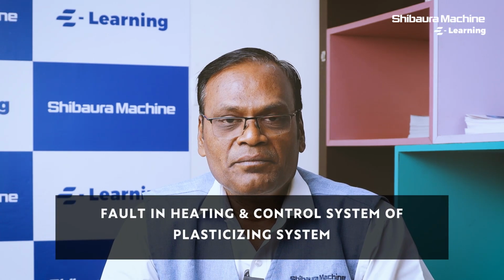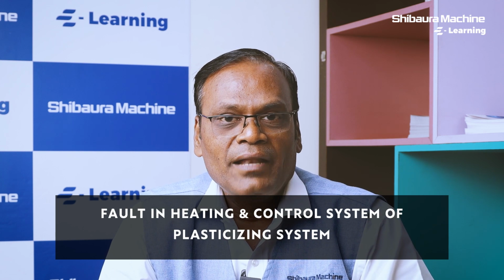Another factor which contributes to short molding is from the heating system of plasticizing unit. Always cross-check the functioning of heaters and thermocouple of plasticizing unit so that the temperature is maintained within the recommended range of polymer manufacturers.